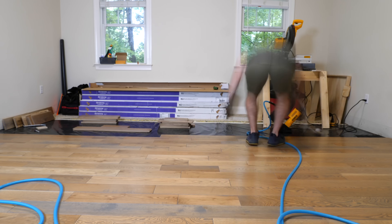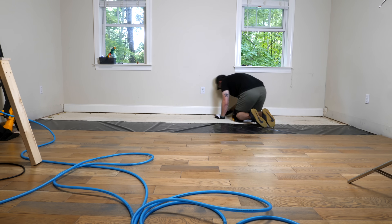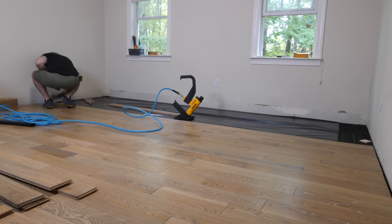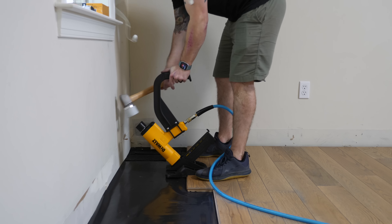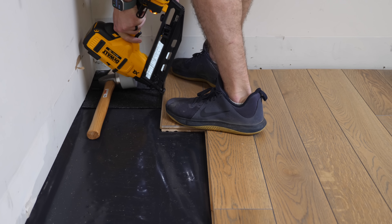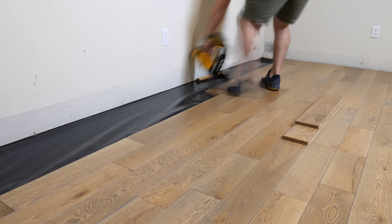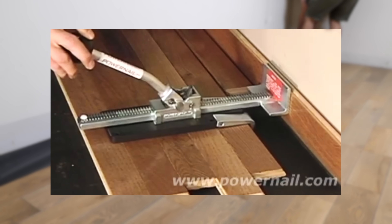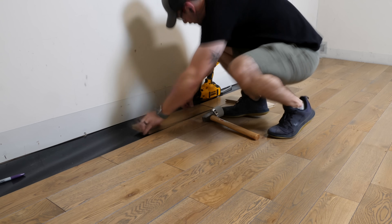I kept installing flooring until I got to the area where I had been storing the hardwood during the install, and had to take a break to move the hardwood, remove the carpet and trim, and add the vapor barrier to that area before moving on. Eventually, when I got to the fourth row from the wall, I started to run into the wall with the mallet when hitting the stapler. After installing that row, I had to switch back to using my finish nailer instead, which still went fairly quickly. The one issue was that I was having a really hard time closing up the gaps between the planks — there's evidently a tool called a flooring jack for this, but I was unfortunately unaware of it at the time.